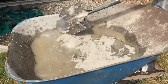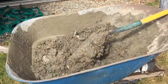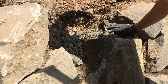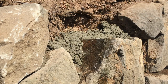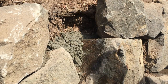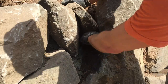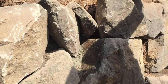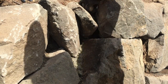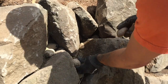Before lifting these rocks, I'm going to mix up a few bags of concrete. Quick tip: pour some water in first prior to the cement bags — that will allow you to avoid lumps and make it easier. With a clean rock surface, dump the concrete into place and mold it into position. Then take the rock and place it on top of the wall, and maneuver concrete in and out of the crack areas so you know you'll have good adhesion. This doesn't have to be perfect — it just needs to provide some support and hopefully stay structural for years to come. After I have all large rocks in place, I take small rocks and place them into the visible concrete to cover it up so it looks nice and natural.